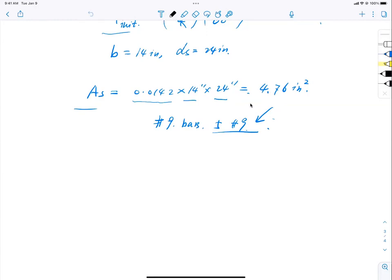Deflection, right? Deflection and a ratio, that's one approach. Remember, how do we determine that? 1/180th of the span length or 1/200 of the span length, right? That's the requirement for deflection. And you go find the height. There are ACI conditions, right, to find the height?